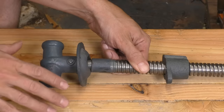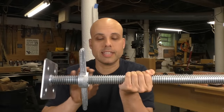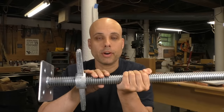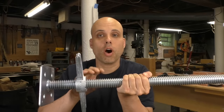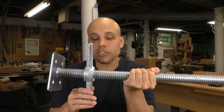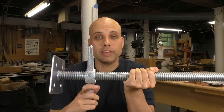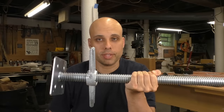So these are the parts that we're going to have to fabricate ourselves. To make our vise strong and also affordable, we're going to build it using this scaffold jack screw. This thing is solid steel, about an inch and three-eighths in diameter, with a very quick, strong acme thread all the way up and down the length. The nut looks like cheap cast material like zinc, but it's actually cast iron, and it's very well fit to the threaded section. It's going to be perfect for this.